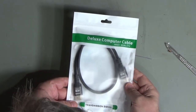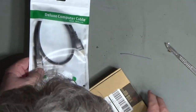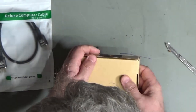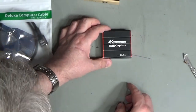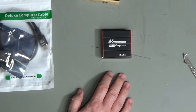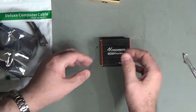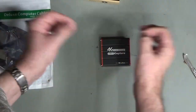Here we've got a very short HDMI cable. The reason for that is I wanted a short cable to go off the back of my microscope — the current cable is far too long. My microscope has a 1080p HDMI output and no USB output at all. This is great in some ways because there's no latency — I can put it straight onto a screen and there's no delay between me moving my soldering iron and the microscope showing exactly what I'm doing. With some of the cheaper USB cameras there was a huge delay.